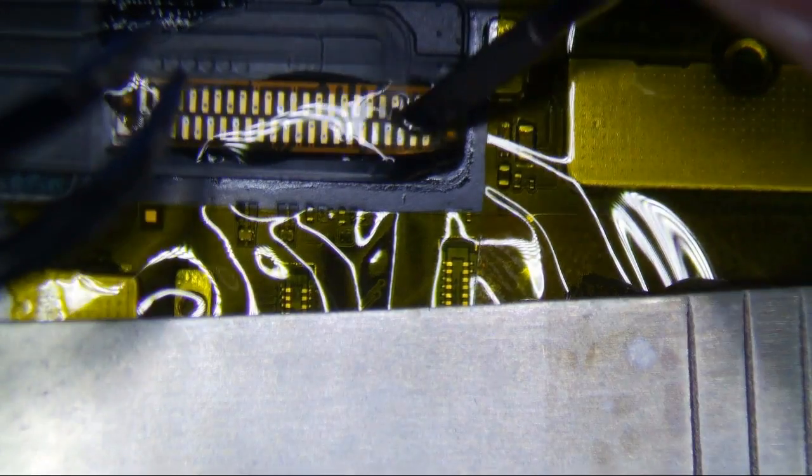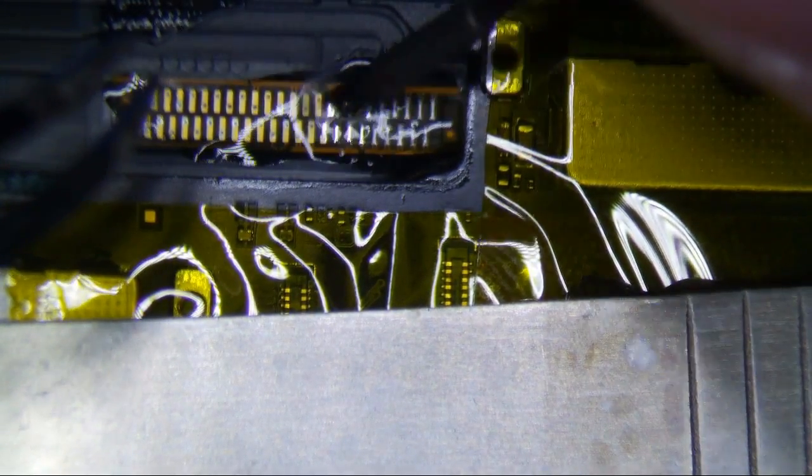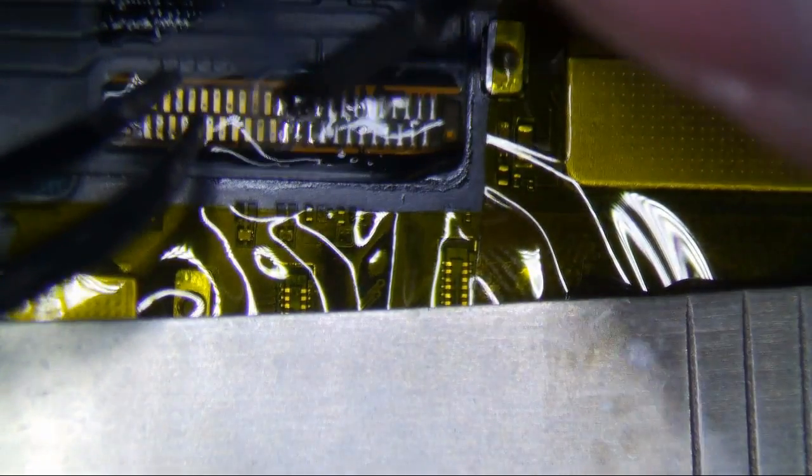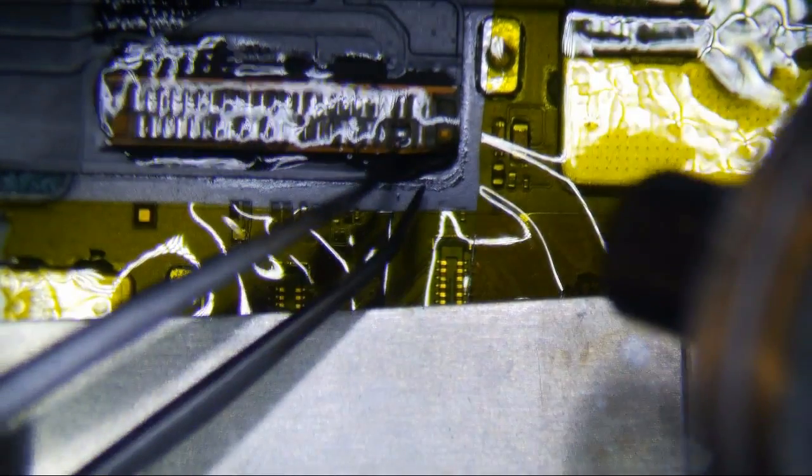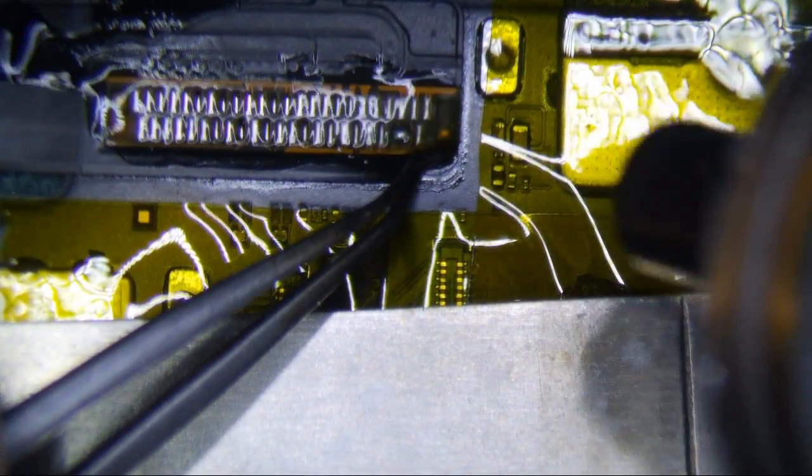A little flux first. I am using Mechanic — it's lead-free tin bismuth, 42 tin 58 bismuth solder paste. I'm just going to lightly brush it over the connector and mix it in with the lead-free solder. Essentially what it does is it lowers the melting point of the lead-free solder that was already on there, making it a little bit easier to remove.